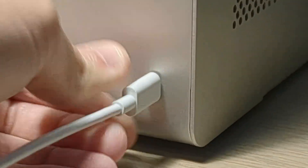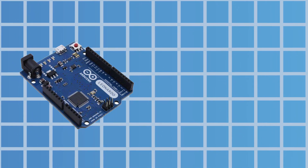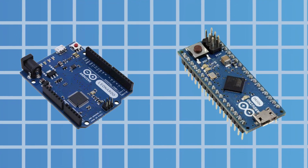I need to find a way to send signals to my PC as if it were a keyboard or controller. The good news is that Arduinos can be used for this exact purpose - by plugging them into the USB port, you can get them to be recognised as a generic input device. The bad news is this really only works for the Arduino Leonardo boards, the Micros, and a few others - none of which I own. So I guess I'll have to wait for Amazon to arrive.